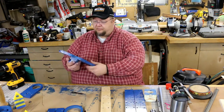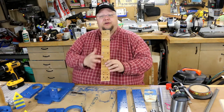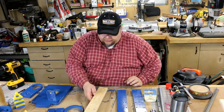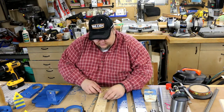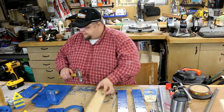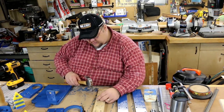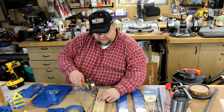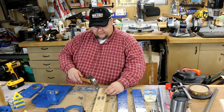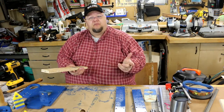We're back — got our parts all prepped. I took everything apart after the dry fit and now I've painted everything. In some cases I used a clear coat just to give it a little contrast, something unique to my machine. The first thing I need to do is get some T-nuts pressed into these holes. What these T-nuts are going to do is allow me to screw the router mount in from the front. I put in an extra set of holes to give me some adjustability — if I need a little extra height I can raise it up. Now that those T-nuts are in, it's time for a little assembly.